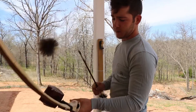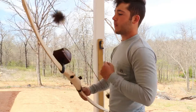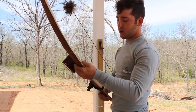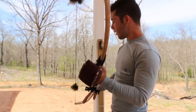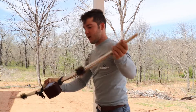Once you get that done you need to seal it. You can use stain and seal - that's what I'm going to use - or polyurethane. You want to do that to keep the bow from drying out. As far as reflex goes, I'll show you all - the reflex we put in it is gone.